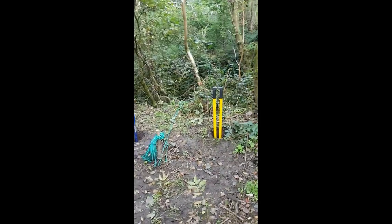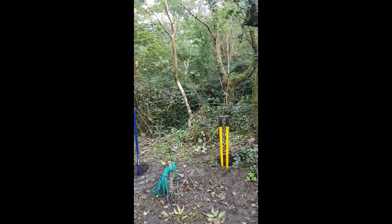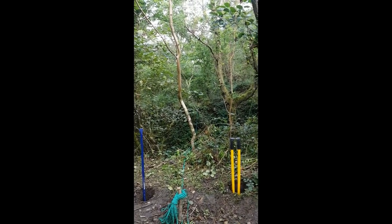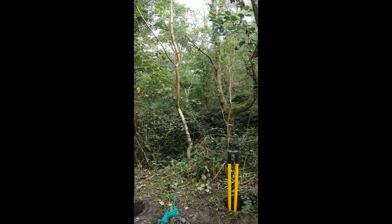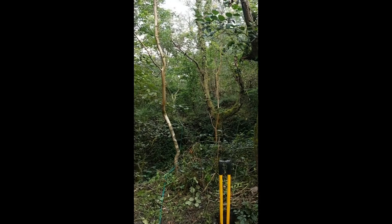This is a classic suspension bridge. It's two 12mm steel wires that are going to form the deck, and another two 12mm steel wires that will be a metre up on these two upright posts. And that's going to form the uprights, and then there'll be a lacing of smaller wire that stitches it all together, and then boards. And exactly the same over the other side.